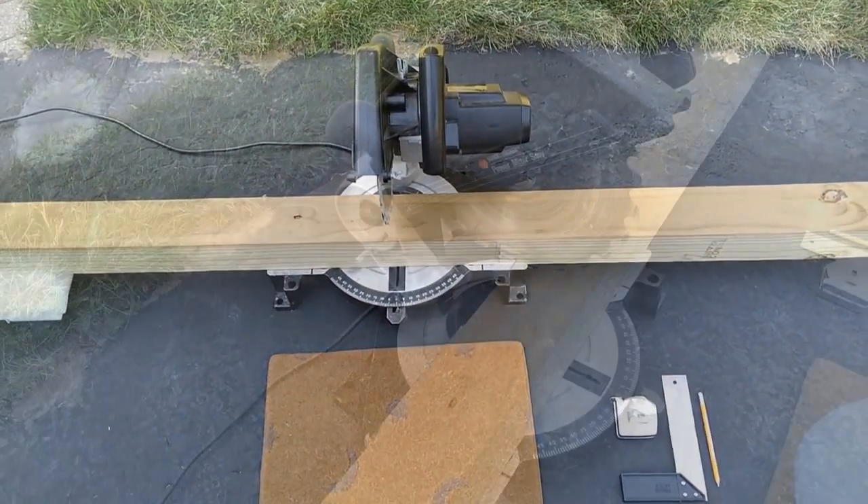You can just use a little sanding block to knock the edge off of this a bit — that's just 150 grit. Then pull on those corners a bit. I'll go all the way around on both ends like that, and then I'll do the same to my second addition that I'll be putting on.